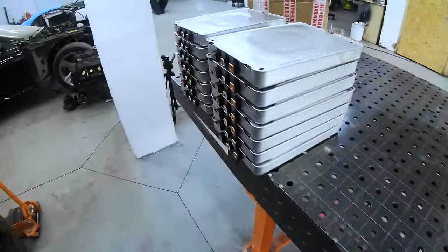While pumping the system, Alexei adjusts the units' communication. The brake fluid is already reaching the calipers. We're almost done pumping. We use a lever to pump the brakes while Alexei adjusts the brake master cylinder control unit - it works, assembled from improvised materials as a very simple lever. After 15 minutes of these simple movements, the brakes are pumped and we can move on. The next stage is the cooling system - we pour in plain distilled water to test it all out.